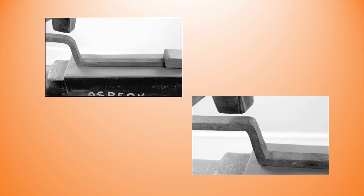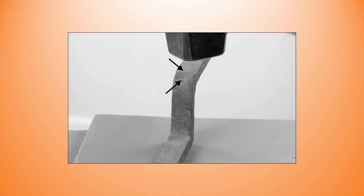Because I've kept the included angle of the first corner open of 90 degrees, the stock can open out as I work on this second corner. To help prevent that, I work along the anvil, and then I have a bottom tool, in this case an anvil block, in the hardy hole acting as a stop. I usually stay at the anvil once I get to this stage because I don't want to move between the two, and I work up both sides of the corner.